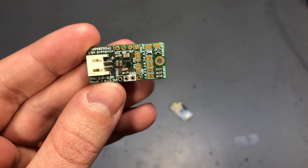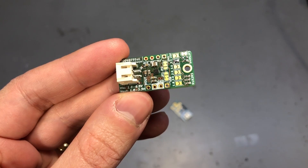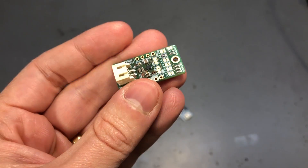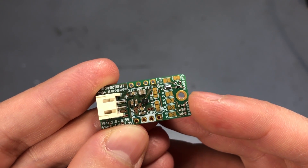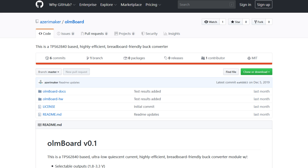You also have a selection of solder mask colors with no extra cost and affordable laser cut stencils, so it's definitely worth checking them out. What I have here is a development board for this chip called the OLM board, sent by one of the viewers of the channel. It features a TPS62840 as well as supporting circuitry, various jumpers to select different operating modes, and 5 resistors to allow you to select 5 common output voltages: 1.8V, 2.0V, 3.0V, 3.3V, and a 5th unpopulated position where you can solder your own resistor. This board is open source and I will link the GitHub with source files in the description below.